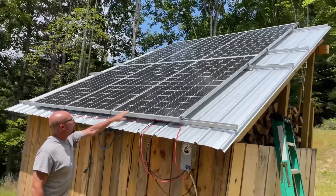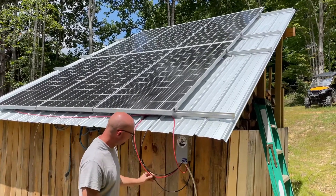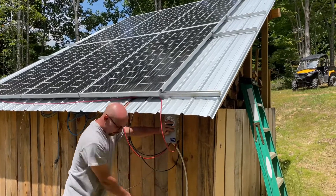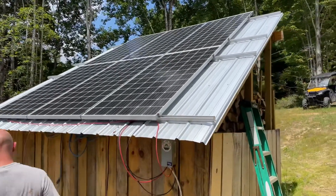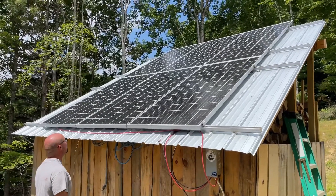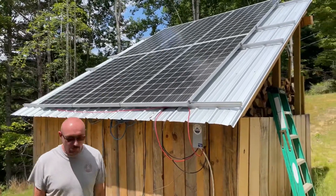So we have our solar panels installed and we have them running in series of two sets of three. We run our negative and our positive down into this combiner box, also from Missouri Wind & Solar. Power goes in here and then comes back out into this pipe here, runs in the ground, back into the house, into the charge controller. How do we know to go with just six panels? We just added it up — these combined produce 2,130 watts of power. So based off of what our needs are. And we may have to add two more in the future, we just don't know yet. We haven't been through the winter yet.